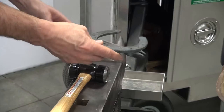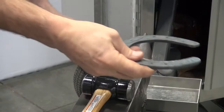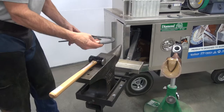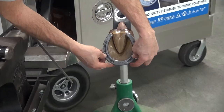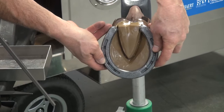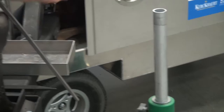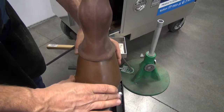I want this shoe to come up in this heel and start coming up at the toe. I'll make a few hits and look at it again. I've gone just a little too much on this side. I'll set that back down and check the shoe again for shape. Using my fingers — and we can also pull the horse's foot forward — we'd look at that shoe from above, put it in the position that you anticipate nailing it.